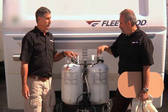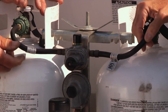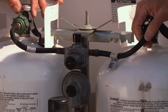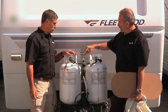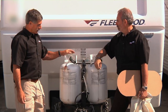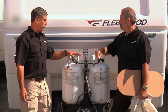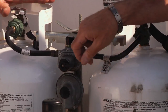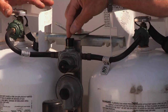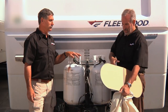Here's a perfect example of why you want to keep these things covered — the sun has caused these hoses to really turn into just a rigid piece of rubber. Once you get the cylinder tied down and secured with the wing nut, you can put a cover on it. First thing you want to do after filling these with propane is check that wing nut, double-check it, and make sure it's tight. Because if they come off, they don't bounce very well.